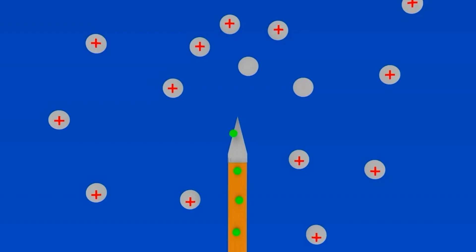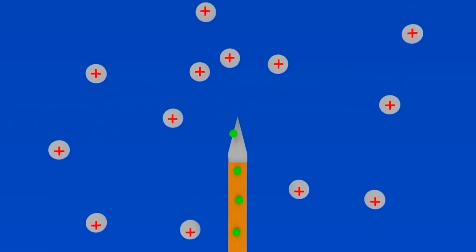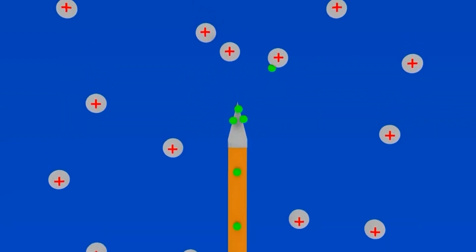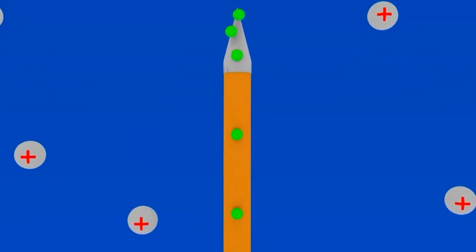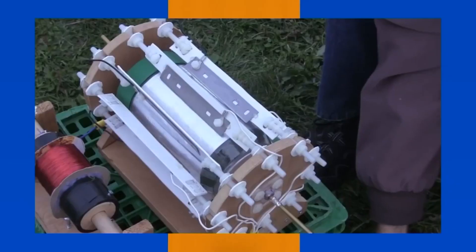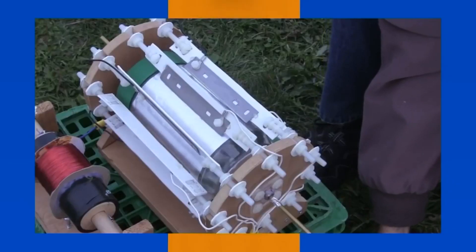But due to the voltage, there are fresh positive ions moving downward and fresh negative charges coming up from the wire. We now have electricity flowing through the wire. The electric current in that electricity is very weak though — I'd estimate it in the low microamps, or more likely even lower. That's not enough to turn an electromagnetic motor like you use in everyday life. But it is enough to turn an electrostatic motor, like this corona motor.